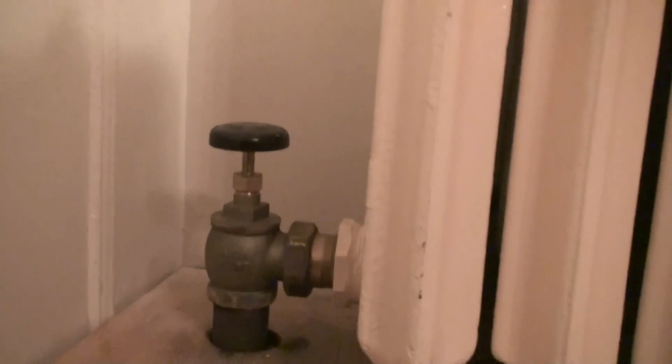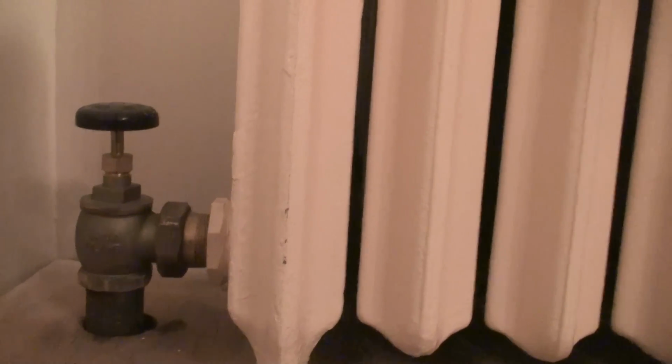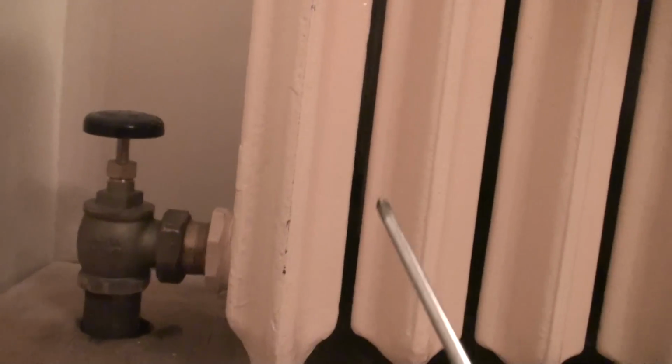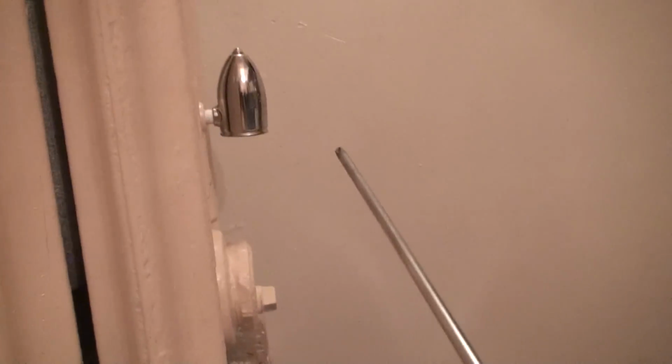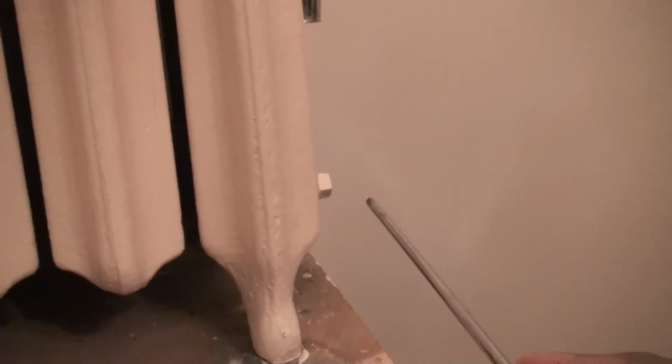The next most effective way to do a hot water system, once again, very similar to an effective way of doing the two-pipe steam system, or exactly the same principles, just minus the trap valves and minus the steam outlets. You want to run it end to end on the bottom connection.